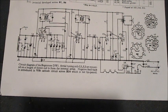Now, if the incoming signal fluctuates too much, there will be some variation in reproduced signal that will be noticeable. Why? AGC systems are not perfect, but they work quite well on the long and medium wave bands. Not quite so on domestic shortwave receivers, since there are more rapid and violent fluctuations occurring. As I say, it is not my intention to go into any great depth here.